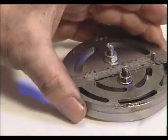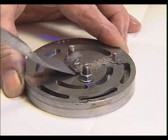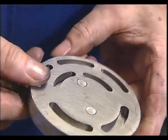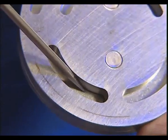After taking off the cylinder head, the valve surfaces are thoroughly cleaned. Then the functionality of the lamella or reed has to be checked. In the event that one reed is defective, replacement of the complete valve is necessary.